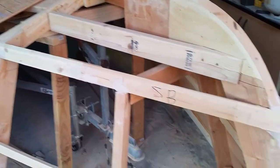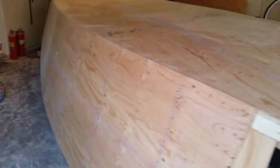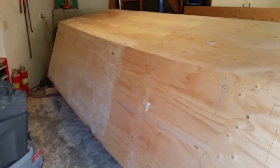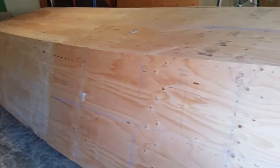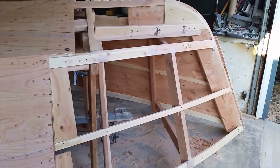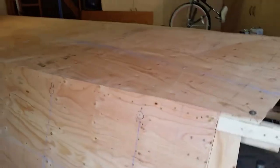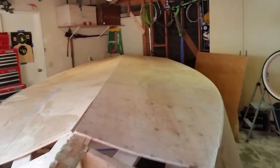Today I'm going to be talking about the different tools that I used to build the frame of my boat and the hull. What I have here is a 22-foot design that I got from Spirit International. Originally it's listed as the Quintana Panga, and you can find it on spiritinternational.com. The boat started off as a 19-3; I extended it to 22 feet, and the beam originally was 7'8". I extended that out to about 8'9". As you can see, I'm doing plywood over frame construction.